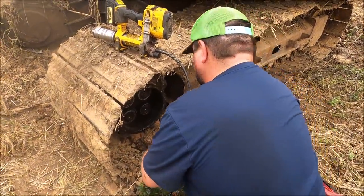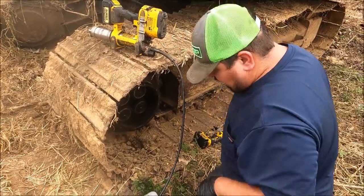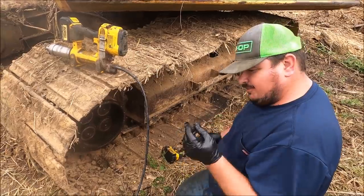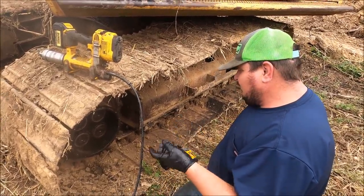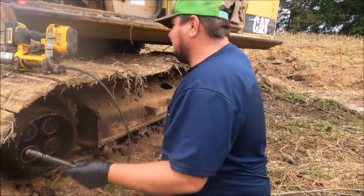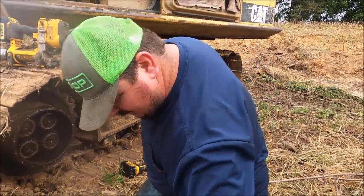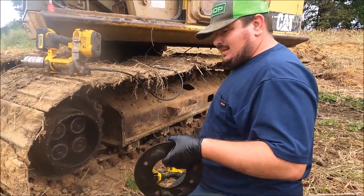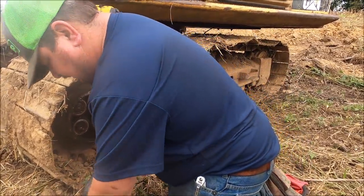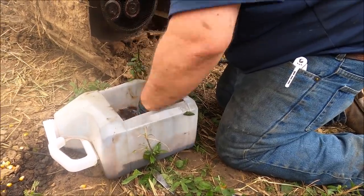The model that replaced this was Cat 312. And we just happened to know somebody that had a Cat 312. We went and looked at the shaft on it, and it was just about a half inch longer. Well, anyways, we took it, milled it down to the same length as ours, came over here, put it in for a test, and it worked. So if you have a late model E120B, you can use a shaft out of a 312, you just got to modify it. But that might be good for somebody to know down the road.